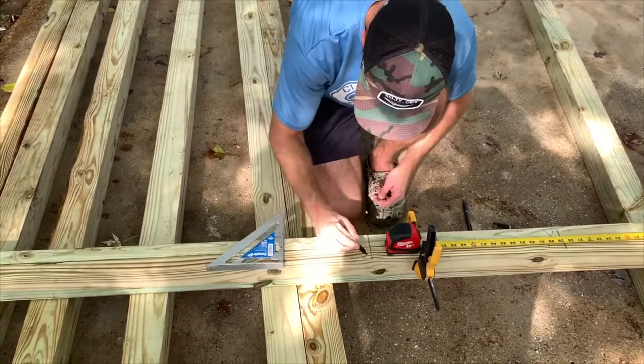So at this point, we need to connect the shed light wire that's going to the receptacle box at the light to the receptacle box for the light switch and power. So to get through the studs, I'm drilling small holes about 1/2 inch through the studs with a little drill bit right there. And once we route that through, we can take the power cable and feed it into our switch box. On the outside of the shed, here's a look at me routing that through.